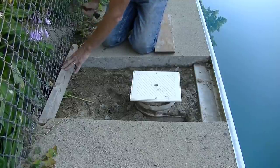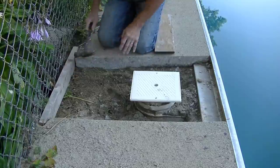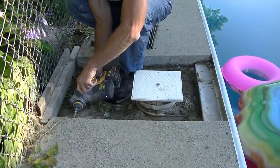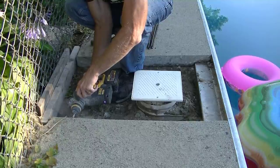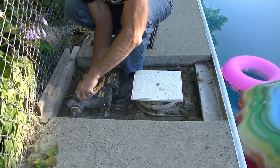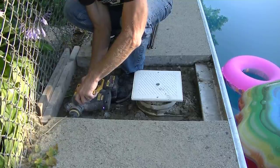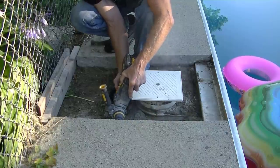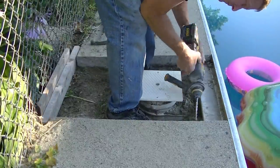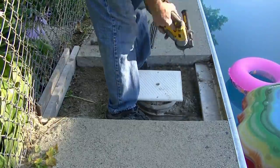Here I am putting in my form — just a simple little two-by-four to hold the concrete. Now I'm drilling and pinning the new concrete into the old because I don't want this concrete to settle, lift, or create any type of trip edge when the kids are running around the pool deck. I'm going to drill it and pin it together so it'll never move or separate.